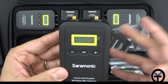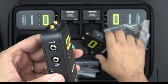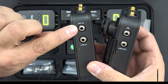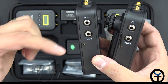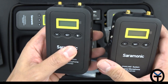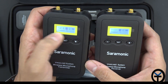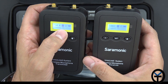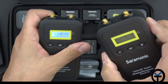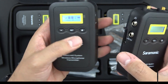The transmitter has pretty much the same setup as the receiver, with the exception of the output — it has a mic line in and antennas, but no headphone jack. That's the main difference between the two, besides the labels identifying them as transmitter or receiver. You connect the line in or the mic in depending on your source. Both units come pre-synced, so pressing and holding the power button on each should bring them both to channel one. The transmitter shows the signal strength and microphone volume level. The mute button on the transmitter blocks the input, while on the receiver it blocks the output.